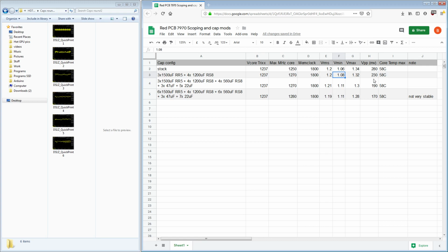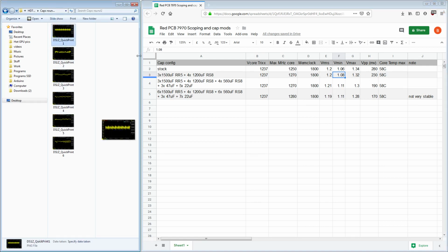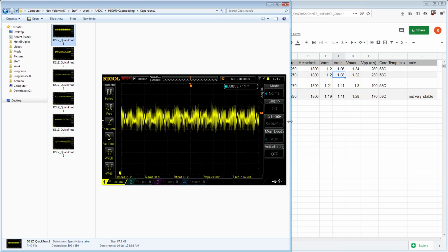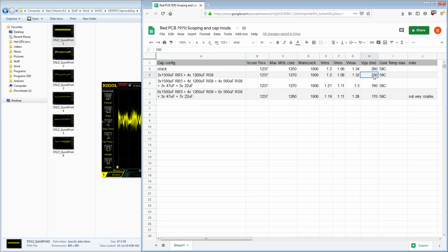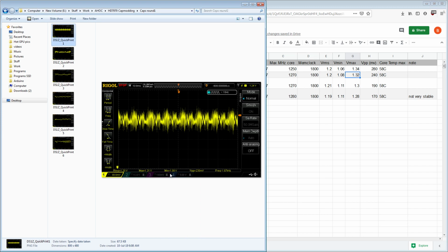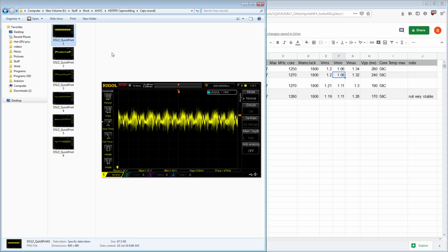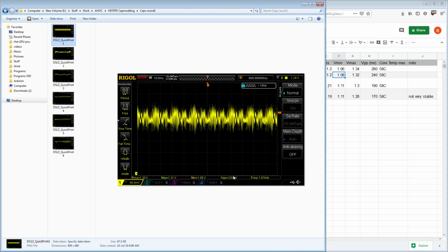Yeah, so decent improvements right off the bat. And the end result is that the graphs on the oscilloscope look like this. You can see peak to peak is, I think, 240 millivolts. Idiot me. The thing is, I don't have a capture of everything, because sometimes I'd have a peak of 1.32 and sometimes a peak of 1.31. Here I captured a moment when we have 1.31 peak, minimum 1.08. But the notes are considering the full passive GT1, so not just one single capture. Anyway, if we look at that, we can still see it's a mess, but it's a smaller mess. Peak to peak is now 230 instead of 280 millivolts, so that's progress.